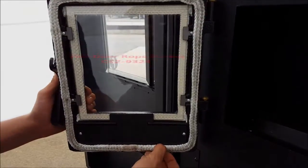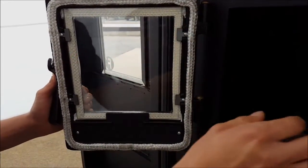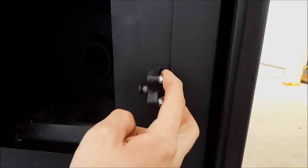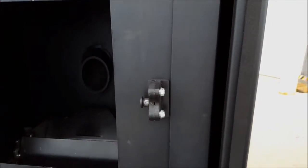With the fire door, unless your gasket is too dry rotted, you can go through and pinch it to help bring some of the life back. Or you can utilize the positioning on the latch point by loosening these two bolts with a 5/16 socket or wrench, bringing that latch point inward towards the heat exchanger.